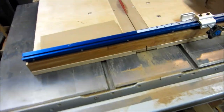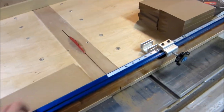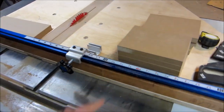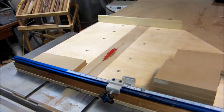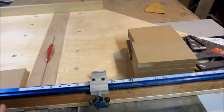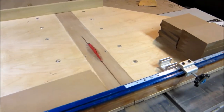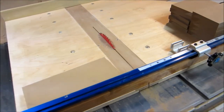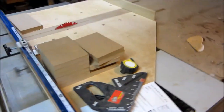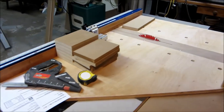That's pretty much it — I love it, it's a real good sled. I literally had it perfectly square on first setup, which is unusual. I took a lot longer to screw the fence on, but I got it perfectly square with these aluminum bars, which is unusual — you usually don't get it that close. For what I do, it's pretty darn close. I'm not even going to try to go down to thousandths or hundredths. The sled's made out of wood and I have a lot of moisture in my basement. If it was made out of aluminum, maybe — but it's wood. If I get within less than a 64th, that's fine.